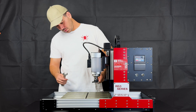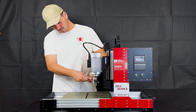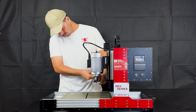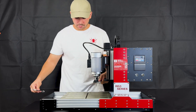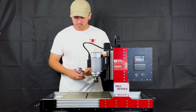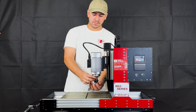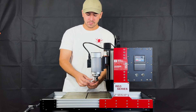Let's take our keys 30 and 19. I will show how to remove the end mill from the ER20 with this spanner. First, we must make sure that the spindle motor is inactive before doing this operation. After placing the keys in place, I apply force — we loosen the connection. I will remove the rest by turning it by hand. We separate the end mill, collet, and cover from each other. Let's take a closer look at how the process is done.